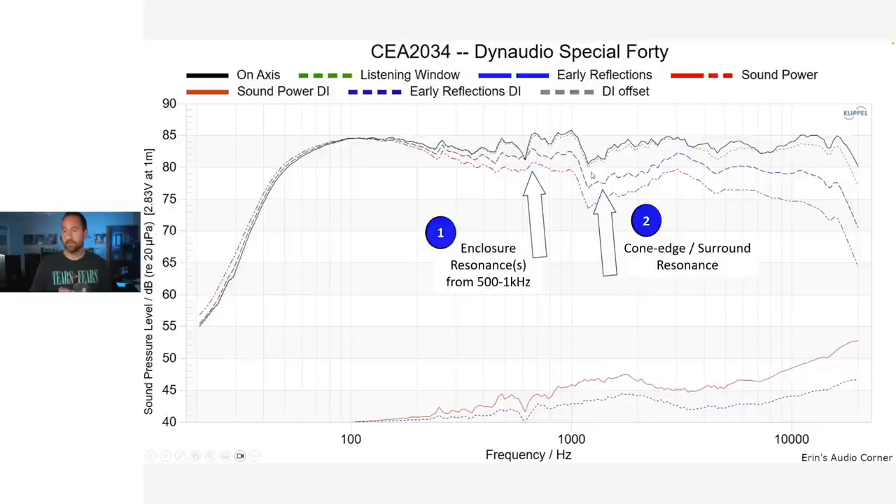There's a dip in the frontal hemisphere of the response that isn't in the back, and I'm not entirely sure what causes that, but it's very interesting. That dip immediately called itself to my attention. From my driver testing experience, I used to commonly see a dip in the response that also matched a blip in the impedance — a resonance in the impedance graph of a drive unit. I saw this commonly from Dynaudio, ScanSpeak, Audio Technology, SB Acoustics — a lot of different companies making drivers in this size range have this kind of issue. The issue is a cone edge to surround termination problem.